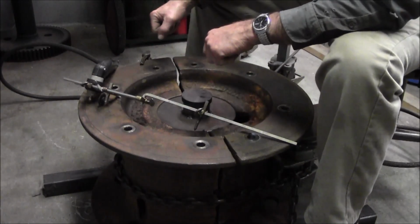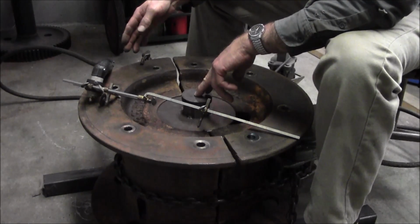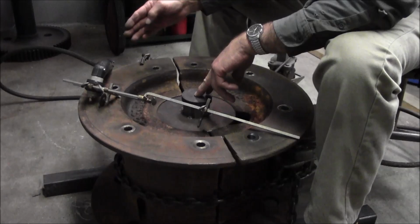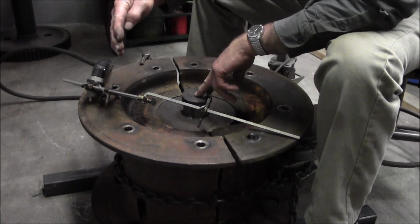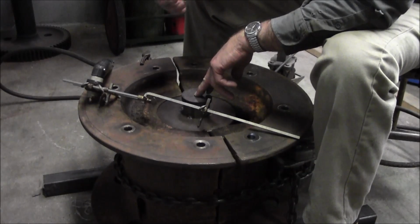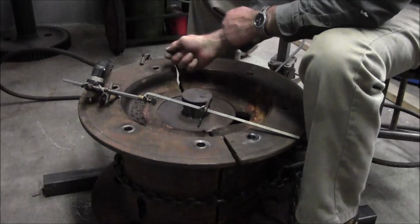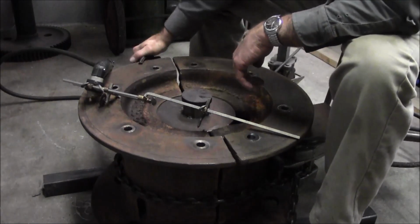When you're holding it there and you've got one plane, meaning from center out here, and all you have to do is worry about your forward momentum, you can control a pretty good arc. Not like the plasma cutter, PlasmaCAM gives me, but a lot better than you would just freehand, you know, sitting there holding the torch like this.